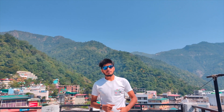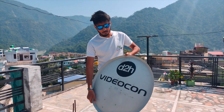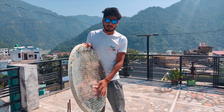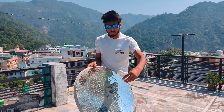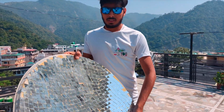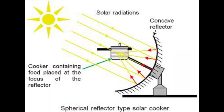So I took one video dish or a TV signal disc — it is simply a parabolic shape, that's why I used it. I simply stuck many small pieces of mirrors on it to reflect the light at one point, so it becomes like a big magnifying glass, converging all the light to one point. It multiplies the power of the sun to one point. As you can see in the image, the parallel rays of sun are reflected to one point — that is the cooker — and that's how it heats up.